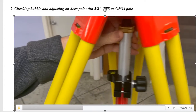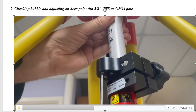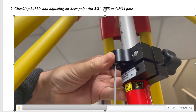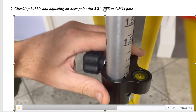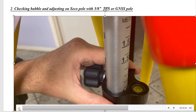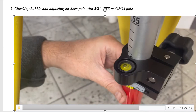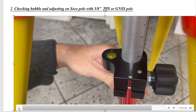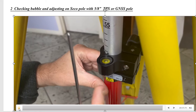We've got our handy tool here — this is a 2 millimeter Allen key. With the screws down here, just a little trial and error, I'm going to turn it to get it in center — just close to center. I want to split that difference. Then we'll rotate 180 degrees, come in, split that difference, and just rotate. I can rotate the four quadrants. Just by adjusting that — it's a little bit of trial and error — you can split that difference and rotate 180. The bubble was out; now it's in adjustment. That's how quick we can do it using this handy tool in the field.